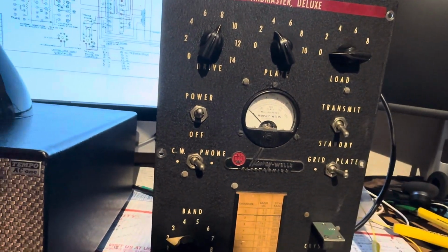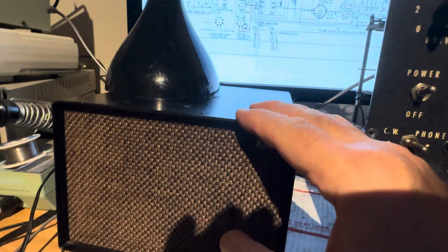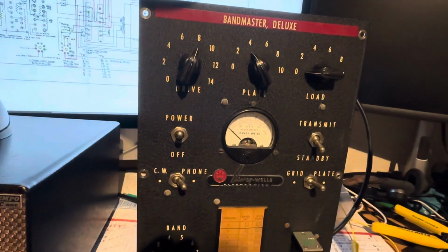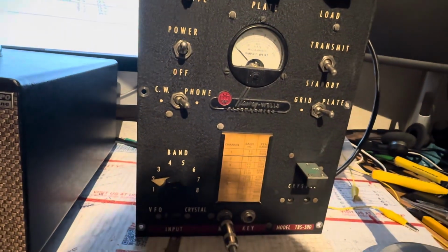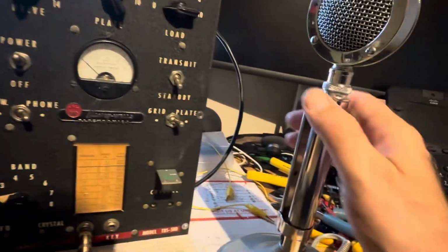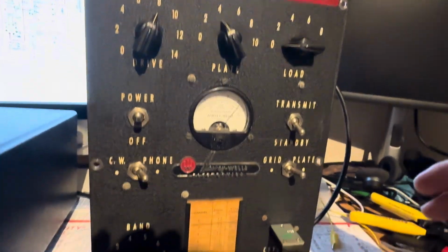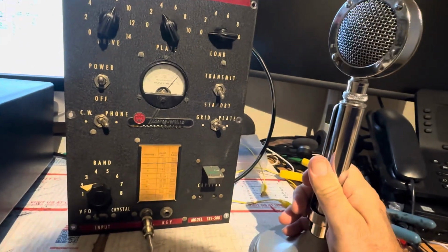Now all the voltages go off because the relay in here unkeys the 600 volts and unkeys the 300 volts. And so the little transmitter here has its tube filaments on, but there's no high voltage going to the tubes. So sure enough, if you kick the mic now, you'll get transmit and power. So I'm happy.